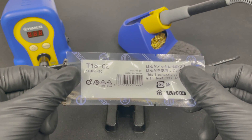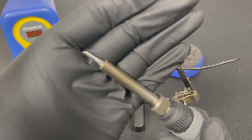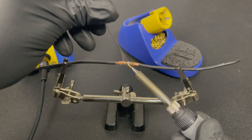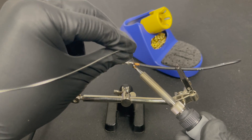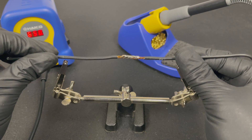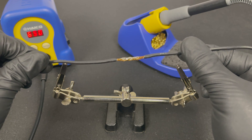For the thicker wire we're going to try the flat part of the hoof-shaped tip. We know this tip is too small to properly heat up a large mass like this thick wire, but we'll try anyway to see how the soldering iron maintains its temperature. As you can see, it takes some effort to get all that mass heated up enough for the solder to melt, and it's not flowing that well. Although it managed to create a strong connection, the solder didn't flow as easily between the strands. The good news is the temperature didn't drop — put a larger hoof or chisel tip on and it will handle thick wires no problem.